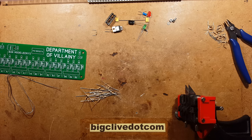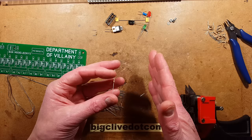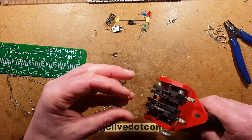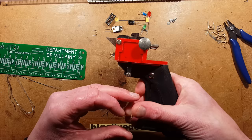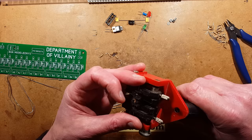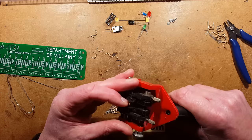MT Noob asks: why do we use solder connections for electronics but not for residential wiring? Some people have soldered residential connections, but to be honest it's more likely to damage the insulation as the heat goes along the thick copper. I think ultimately given that houses were traditionally wired before electricity was even on the premises, the convenience of easy termination into screw terminals won out. That's gone one step further with Wago style spring-loaded terminals, which I approve of. The plumbing has gone the same way — it started with copper and soldering and has gone in the direction of push-in fittings.